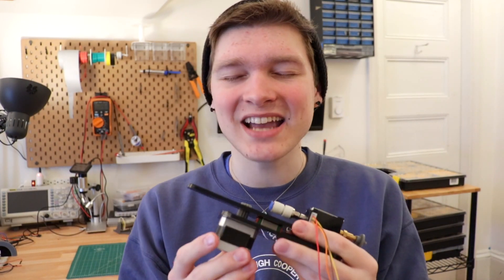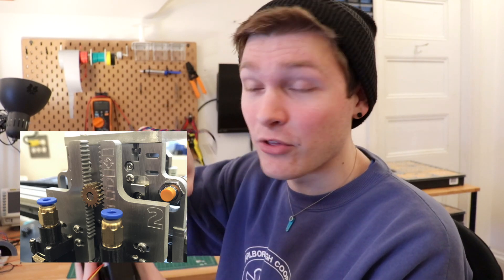As I was assembling this, I thought it was kind of silly to not just do the other design I showed earlier with two nozzles on either side of the one pinion — especially because, spoilers, I'm planning on adding a solder paste dispenser on this thing too, and I'll need some way to move that up and down as well. So might as well kill two birds with one stone and put two nozzles on this one head. I'm going to go back into CAD and redesign this, mirrored over so there's two of them, and this one assembly should be able to move two nozzles up and down.